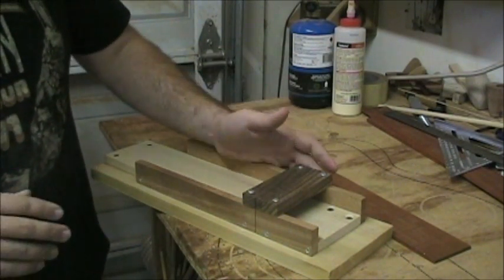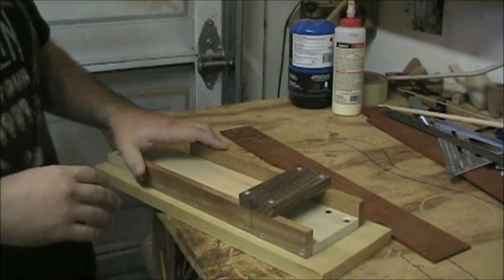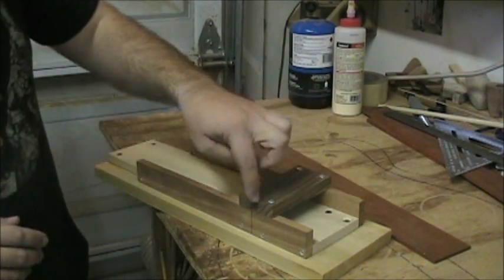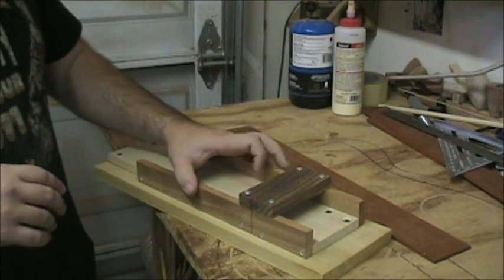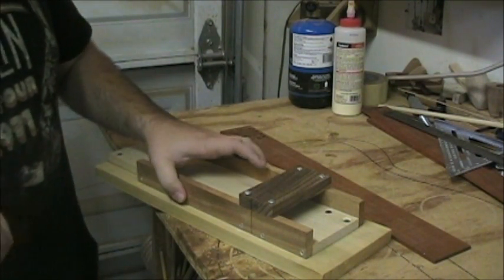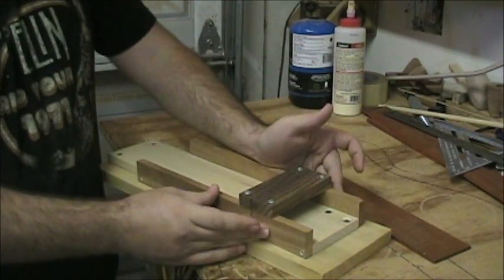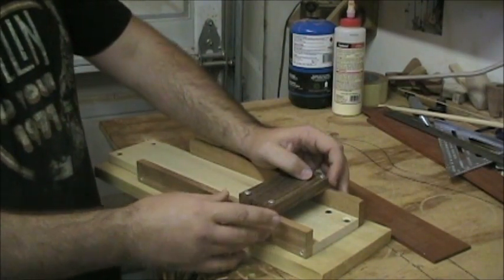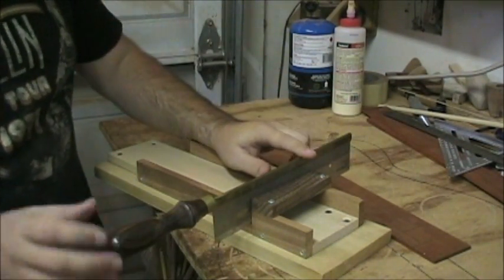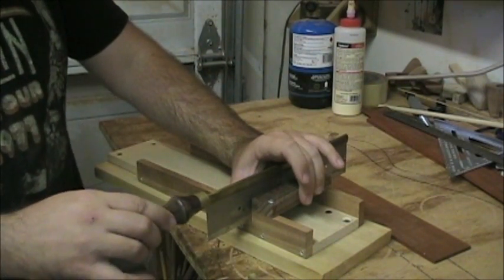To get the slot in here, I took the miter box after it was glued, brought it to my chop saw, lined it up nice and square, and sawed a hole right through it. The kerf on this hole for the fret saw is way skinnier than the kerf made by the chop saw. What you can do is pull the two pieces together after the cut, then insert the fret saw in between them, lay it all the way down to the bottom, and clamp everything together.